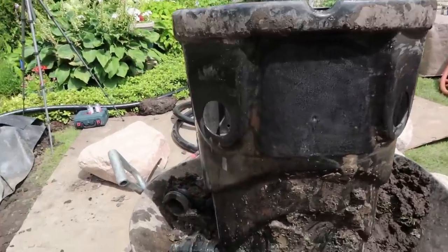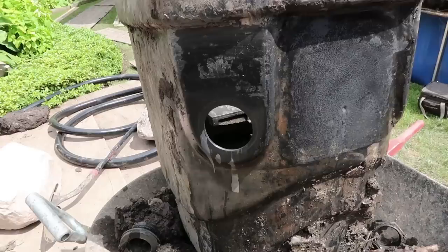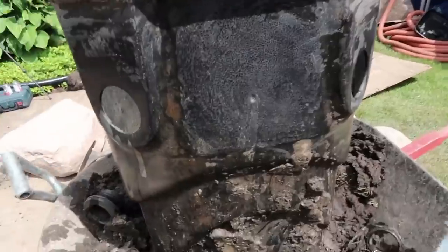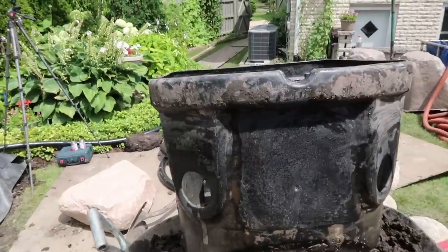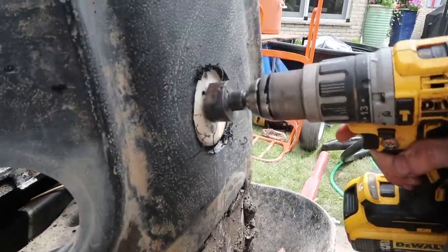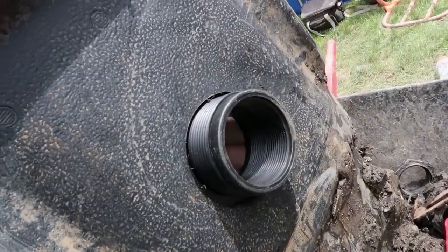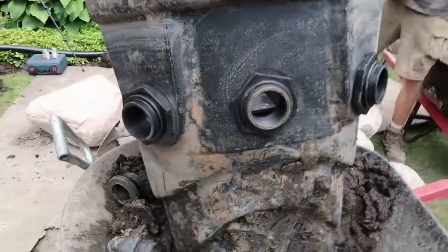We are reusing their existing Signature Series skimmer. Nick and I pulled off the old bulkheads and we're going to be replacing them with brand new ones. We're going to put three bulkheads on this thing — that will be the 5PL, and on that side will be the 3PL. There's a little dimple or indentation in here as a guide for the three-and-a-quarter inch hole saw arbor bit, so that all three holes will be in the same line. The middle one will be the overflow, which ties into that sump pump system. This is a three-and-a-quarter inch hole saw, which fits perfectly for our two-inch bulkheads. The two-inch bulkhead fits nicely through there — rubber gasket on the inside of the skimmer box, plastic gasket on the outside, then attach the collar nut. And there you have the backside of a skimmer: three ports — pump, overflow, pump.